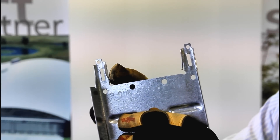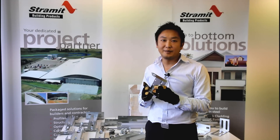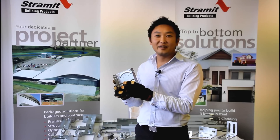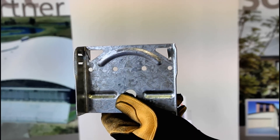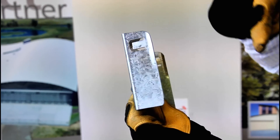If you look very carefully at the ends of these two prongs they have a small spring. These springs are very important because they are the part that clips onto the purlin and makes the system safe to use. This is the lock and this is at the other end of the bridging, locking the system together once you've assembled it. It's easy to recognize because of its square shape and you will notice small tabs on the sides that lock it into place and ensure it's secure. It comes in four standard sizes.